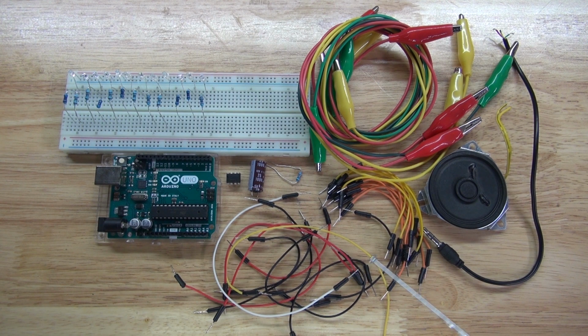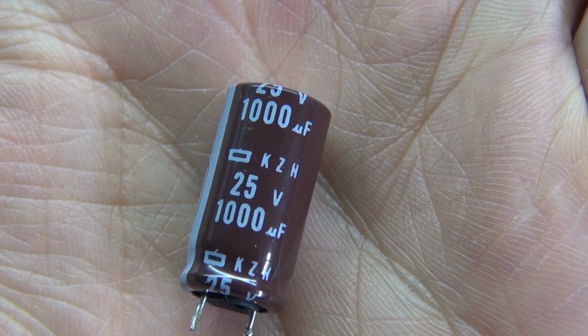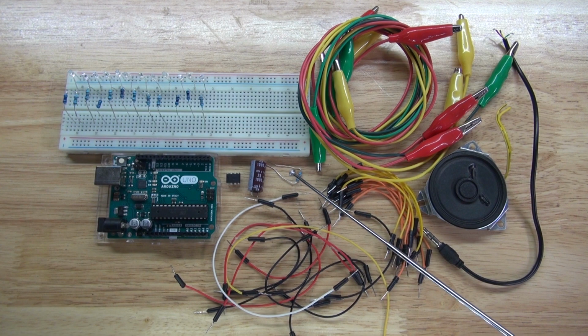To make this project, you're going to need these jumper cables, these alligator clips, and an LM386 audio amplifier to be able to hear this project. You're also going to need a 1000 microfarad electrolytic capacitor, a 220 ohm resistor, a 2 watt 8 ohm speaker, an audio jack,